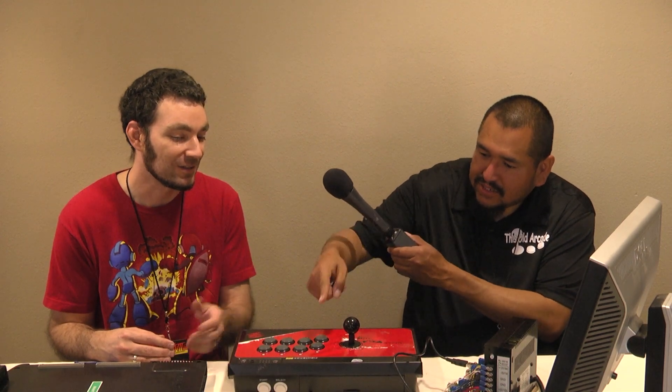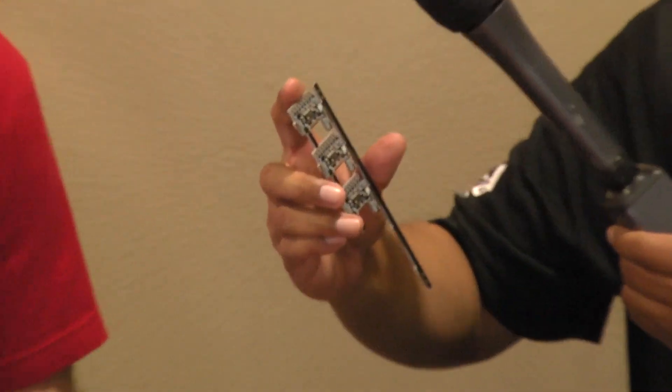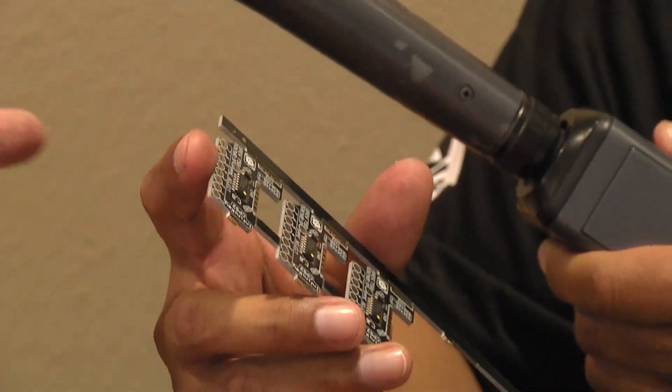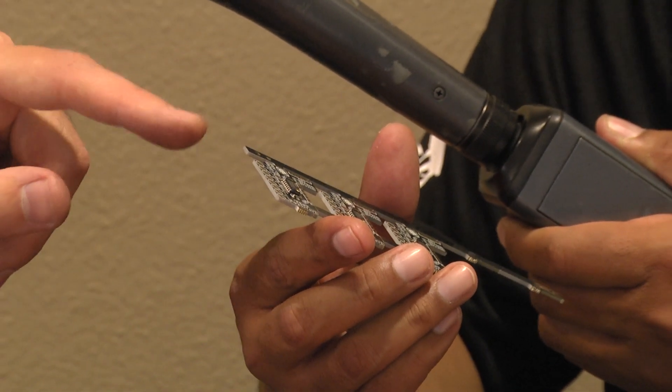I used that for a while myself because I have a bunch of CPS2 games, but it requires some doing to set it up. If you have one game, to go to all that work is quite a bit of setup. So I thought this could really be boiled down into a nice little small board that you could just solder right in, and every time you turn it on it'll load the right key. So this is the board — there are three of them in here. It has all the keys, and you basically tell it which one you want to use based on your solder.